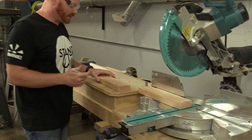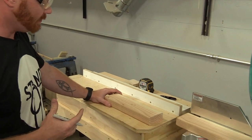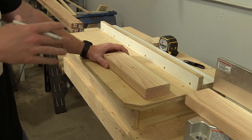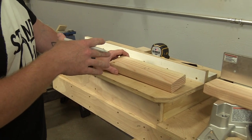One of the things I like to do is mark the pieces. Some of these small pieces are going to look similar. I've got some 14 inch cuts here, so I like to mark them so that I know when I go back through that this is exactly the piece I need when I'm cutting angles.